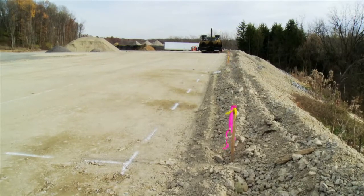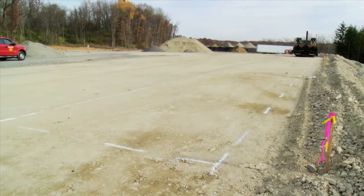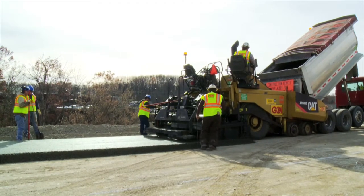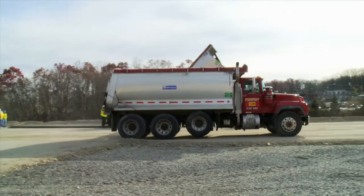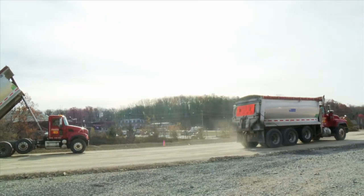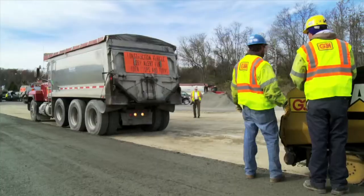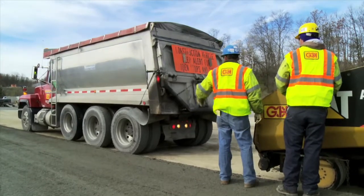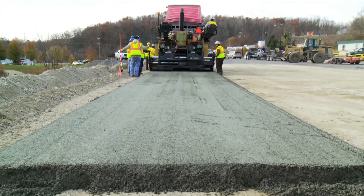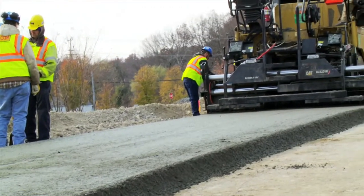Note that no forms have been positioned. The next step is to proceed directly to the placement of the concrete. This is done using a conventional paving machine, just as you would use for placing asphalt on a roadway. The concrete blend is prepared in a standard ready-mix batch plant. The material is delivered to the paving machine with a dump truck, which facilitates easy and continuous feeding of the paver. We have hauled the mixture without complications up to two hours from the ready-mix plant. The paver operator sets up his machine to establish the width and depth of the paving, laying down a six-inch depth of concrete paving material.